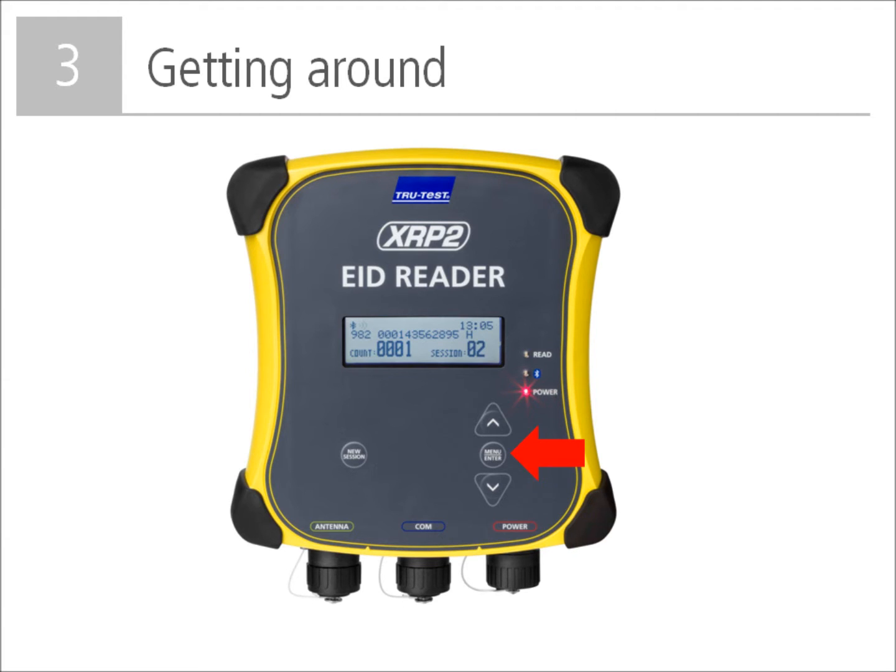At the bottom right are three buttons. The menu button is used to access the panel reader settings. There are three lights on the reader. The red power light illuminates to show the status of the power supply. The blue Bluetooth light illuminates to show that a Bluetooth wireless connection has been established. The green read light flashes once when an EID tag has been read successfully.